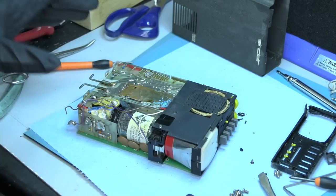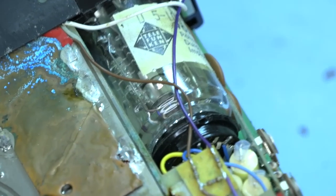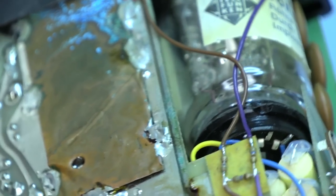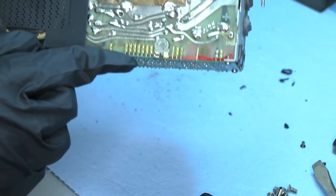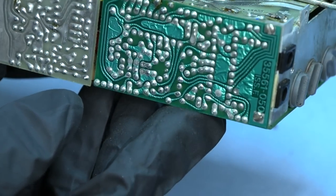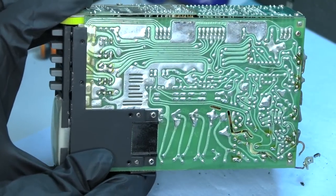Well, let's see what we can see. There's our CRT — it's a Telefunken. It's telling you don't break the glass because it'll implode. You can see some of the beautiful stuff in there — genuine CRTage, the guns. We've got this big pack of all these different boards. We've got some RF stuff on the side, some interesting interconnects here — pins and sockets. Looks like it's just unscrew and those will pull right off. Got some nasty stuff there — obviously the NICADs there underneath that. Bottom side is the main control board.